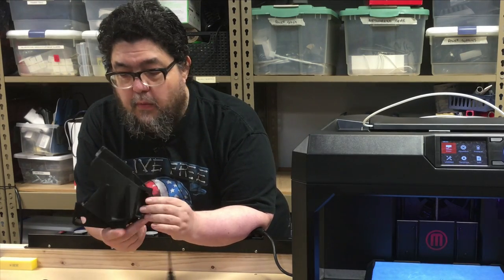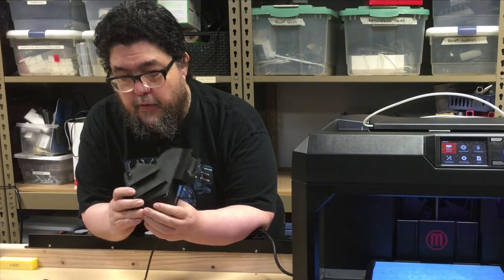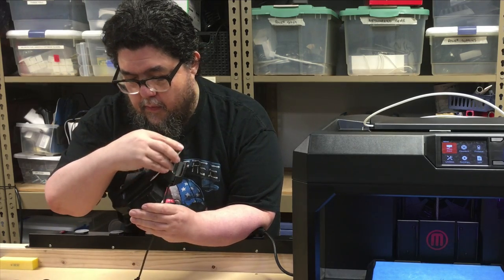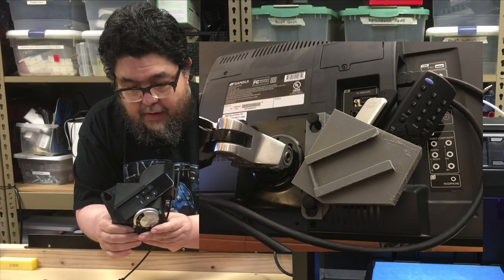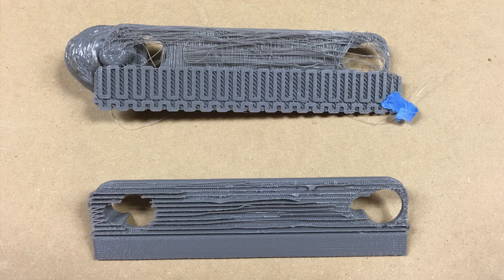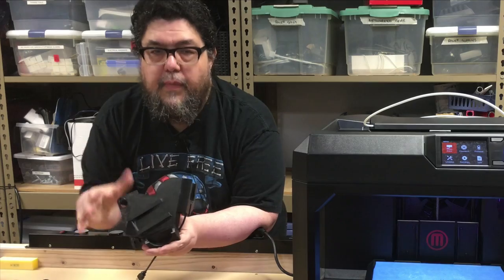So I want to talk for a minute about the lessons learned. I thought of this like a software designer — I built modules and tried to build reusable modules. I built the fan holder as a module, the Apple TV slide as a module, each piece as individual modules and then put them together as a whole. In the first rev I learned that the MakerBot and supports don't go well together. They're really problematic, so it's better to build with as few supports as possible. That dictated how I printed things on the print bed.